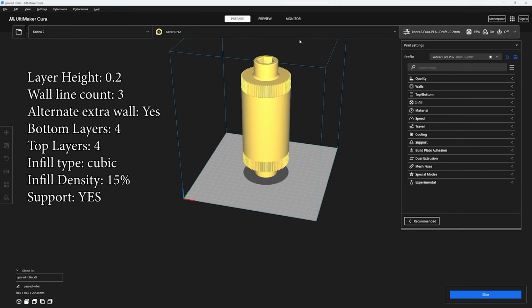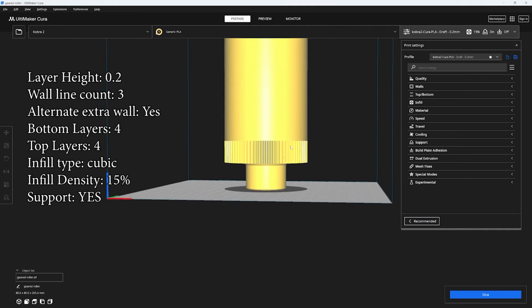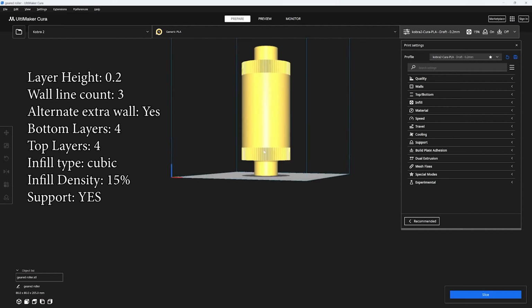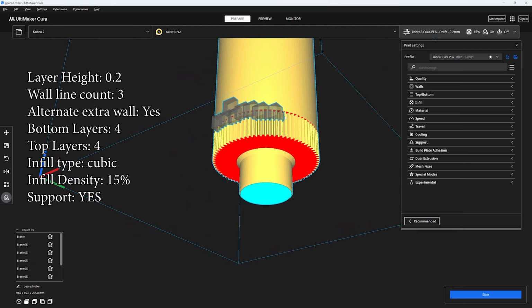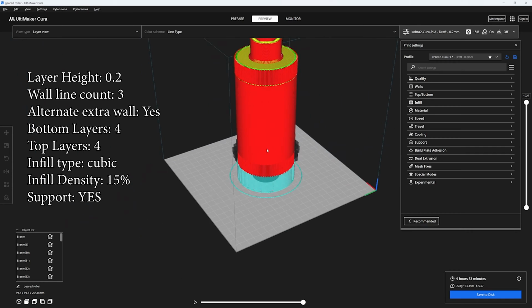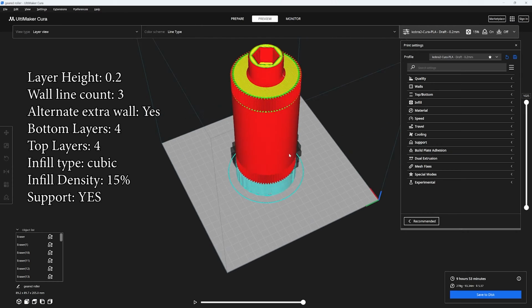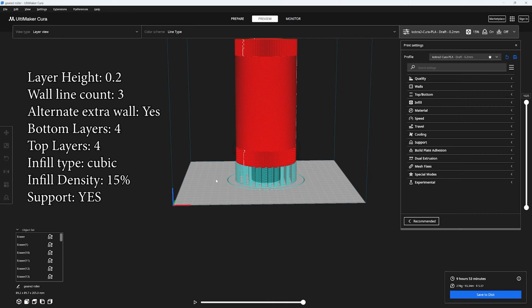Now I left in the files the geared roller for my prototype if you really want to do it, even though I don't recommend it. You definitely want to add support blockers to all these little ridges between the teeth, otherwise it's going to take forever, and this print's already going to take 33% longer than the non-geared version. You're going to have to spend 15 plus hours printing a geared press bed, so in my opinion the geared is not worth it, but I left it in there in case you really want a fully 3D printed press.